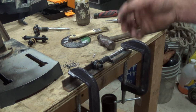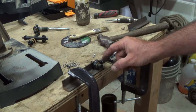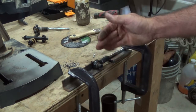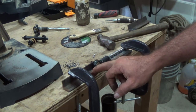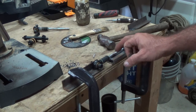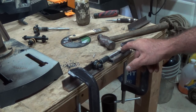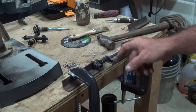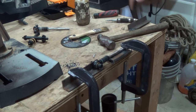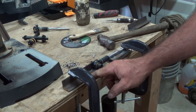The camera died, so I went ahead and finished drilling and deburred it. Anyway, I've got it set up with the bolt going through to keep it from canting one way or the other, giving me the 90-degree angle I'm looking for so both planes are about the same. I stacked it up to where it needs to be, clamped it down, and I'm going to tack weld in a couple places. That way I can finish the weld and still have plenty of room to drill the mounting holes for the post. After that I'll cut it to the size I need.